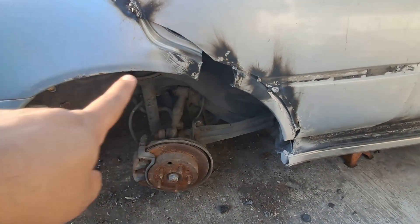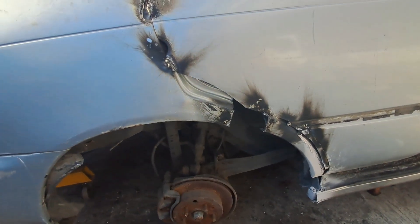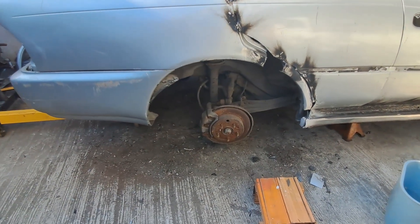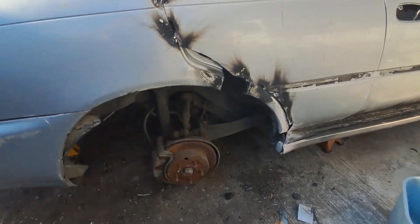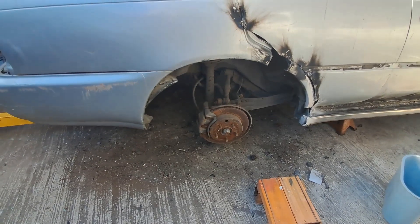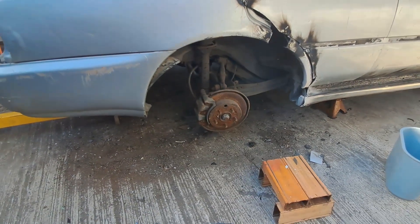For this side, we're going to rebuild this and fill in the gaps so that this becomes a big wheel arch. The wheel arch of the original car is bigger than the Corolla wheel arch, so we have to extend this portion to close the gap. By making this effort, it will allow us to put very large diameter tires here at the back.